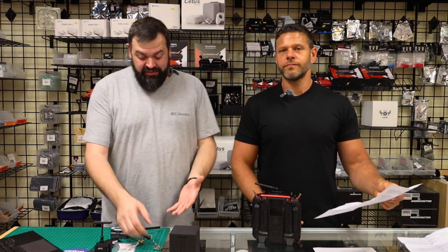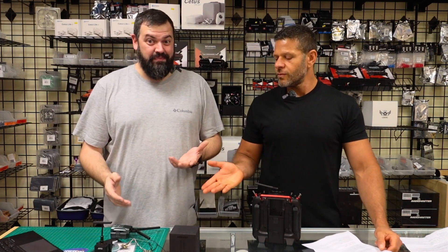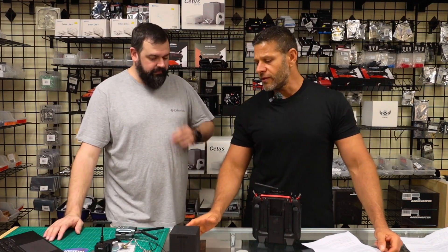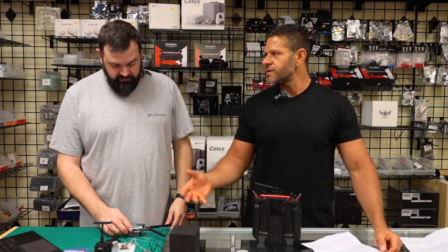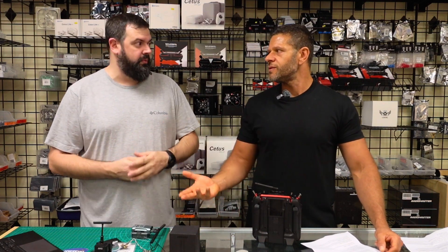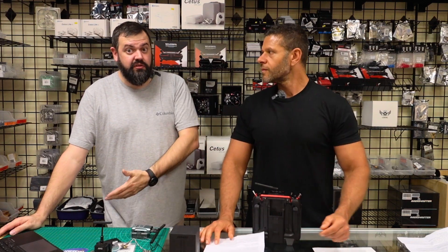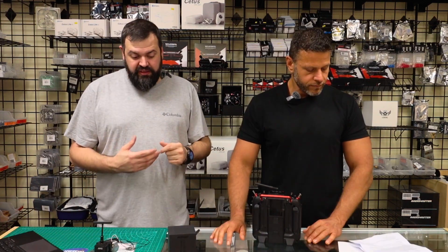If you're flying planes, there's only one receiver right now that supports this. It doesn't come with servo PWM ports — it's just an RX/TX pinout, so you'd have to solder it to a flight controller. If you have a plane with a flight controller, that works fine.